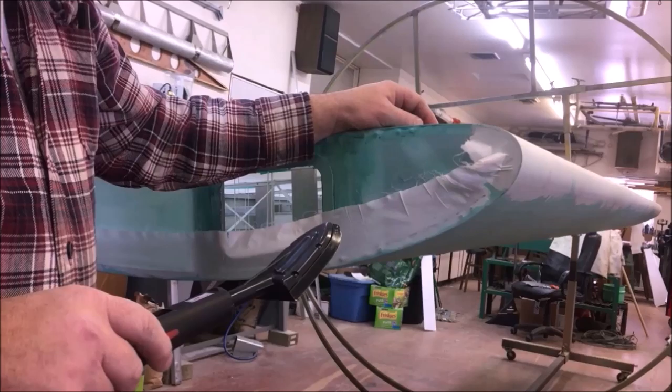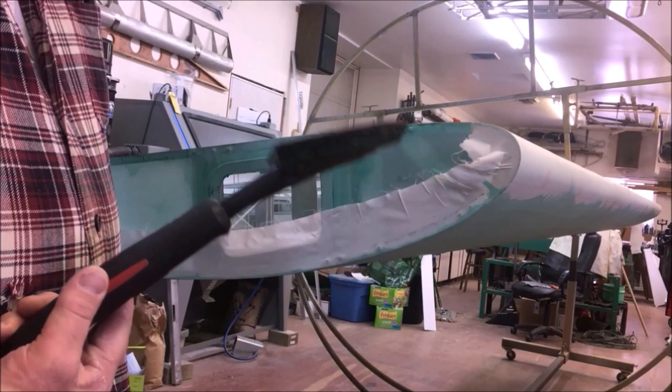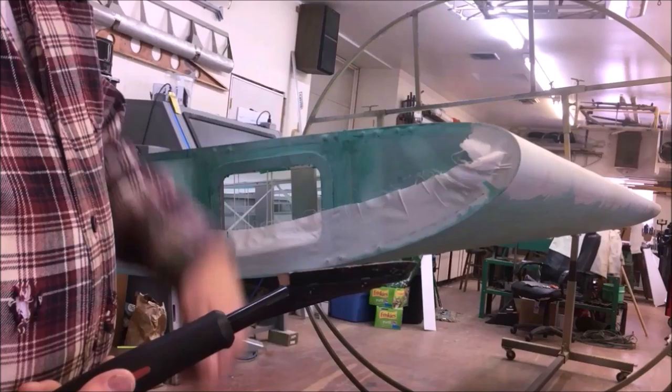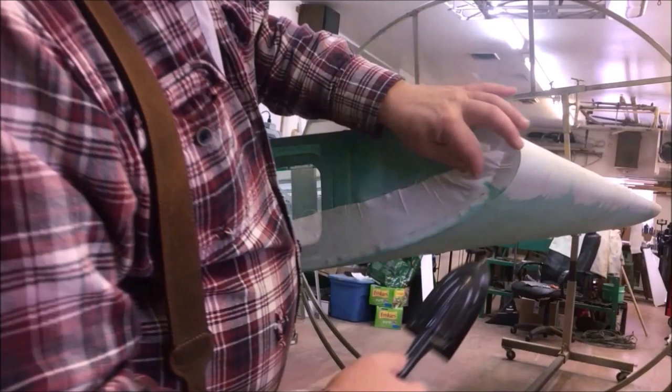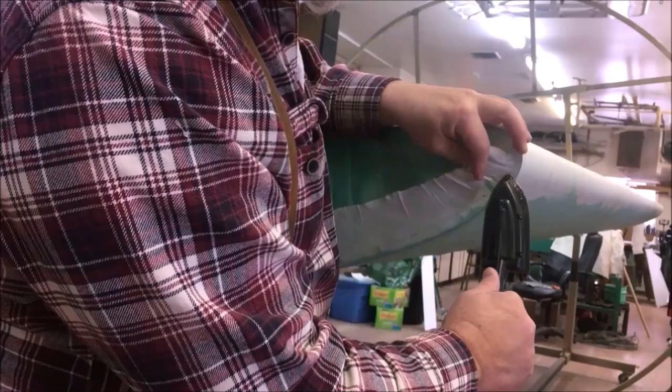It just doesn't happen. So this, I can go to 325. If I want to go to 326, I'll go to 326. It doesn't matter. Another myth that floats around all the time is that you can use the little laser temperature checkers. Those aren't accurate on this. They glance off and you don't get a good accurate reading. So at any rate, candy thermometer is, as Ray Stitt said, the standard, and it is. Candy thermometer, bedded into paper towels.